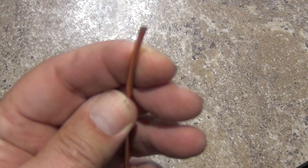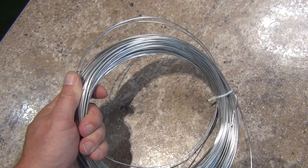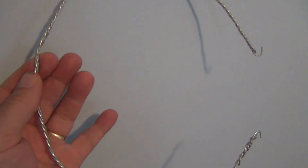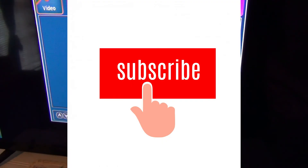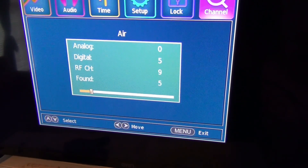So what does all of this mean for the do-it-yourself antenna builder? If you need the best element, spend the money and use 10-gauge copper wire. If you're in an area with a strong TV signal and don't care about weaker distant stations, save some money — galvanized wire will work just fine. If you want to experiment with more gain, try making a twisted bundle element. I'm interested in all of your thoughts, so please leave a comment, hit the like button, ring the bell, and subscribe to my channel. Thanks to everyone who's already subscribed — you are all truly appreciated. Until next time, keep watching TV.